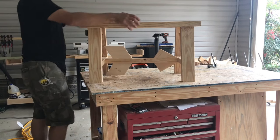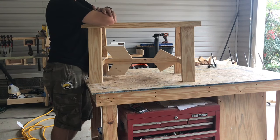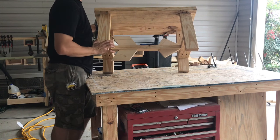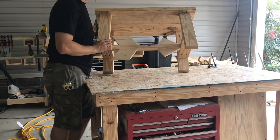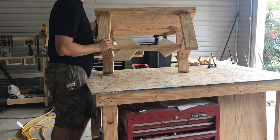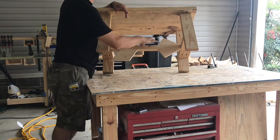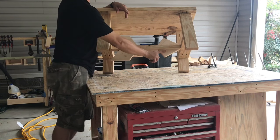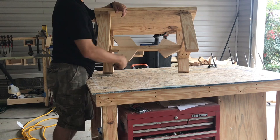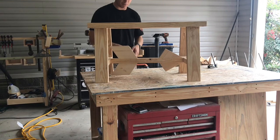There it is — the arrow bench. Solid. It took me maybe two hours even with me videoing it. It usually takes about an hour to an hour and a half. I've still got to sand it obviously. I'll do a little round-over on the bottom of the feet and then paint it. The pieces are four inches long at a 33.6-degree angle. The reason I use 33.6 degrees is that it's a positive stop on the miter saw — that's where it stops, so that's the angle I use. The length doesn't matter; you can build them as long or as short as you want.